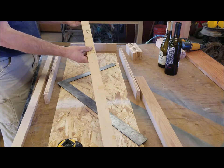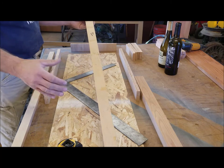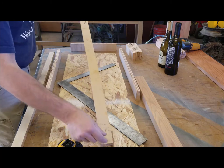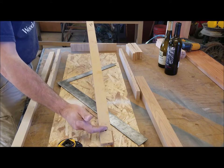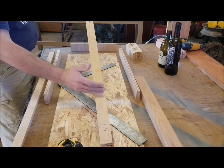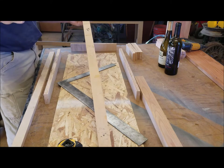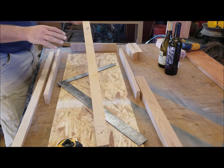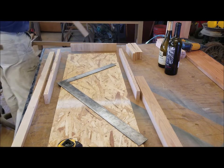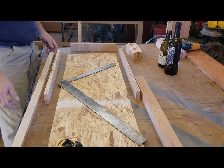I turn it over, and again, this time I have it cut to the full width of the cabinet, and so here I've got an overhang of the cabinet top, then I've got the side, then I have an internal strengthener, then here's where the microwave is going to sit, and so I've got all these things laid out. You can see it exactly. There's nothing that gets missed. This is really huge.